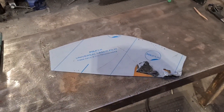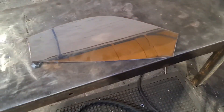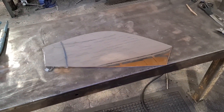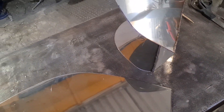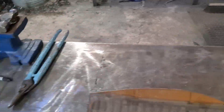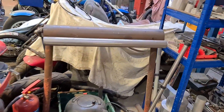With the top and bottom in, we've had trials and tribulation. Now we're going back to CAD - cardboard aided design - and basically we've rolled this around and traced around it. That's given us the template we need. We'll cut that out and then trace around that on the stainless sheet and cut that out of the stainless. So I've got it cut - I just need to do a little bit of sanding, peeling and degreasing.